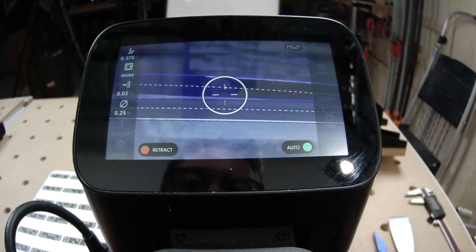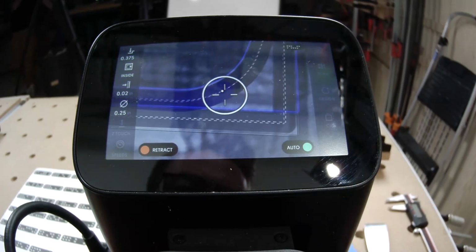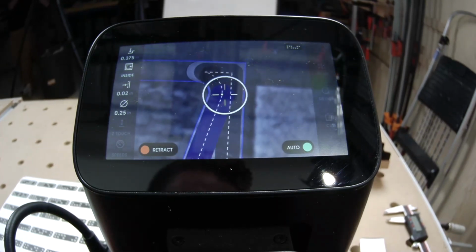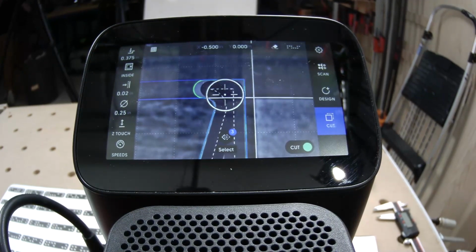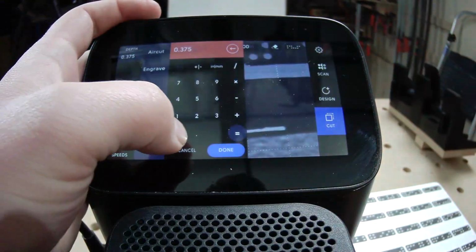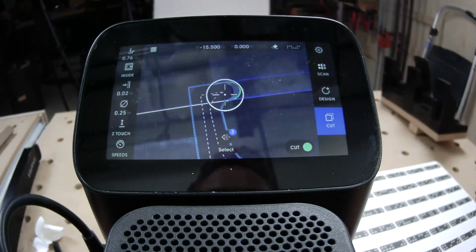Nice thing about this project is that the stock is cut basically to width, so there is some material removal around the ends to shape the profile of this part, but cutting the length of it's pretty easy, not much material to remove there because it's already to width. That's one roughing pass. I think we're going to do this in 2 roughing passes and then 1 finishing pass.